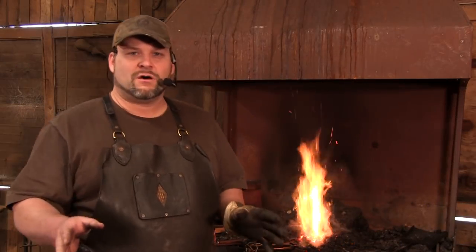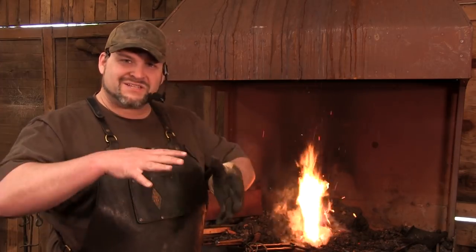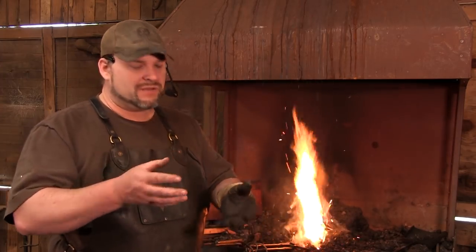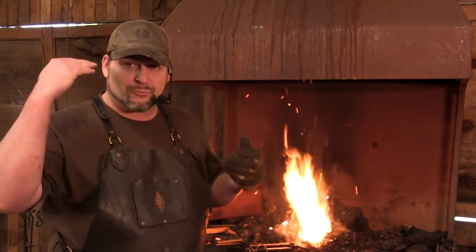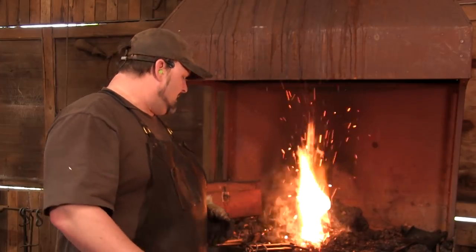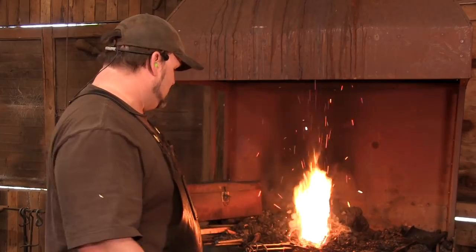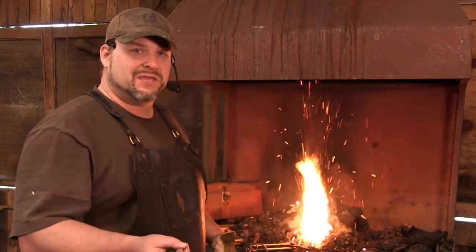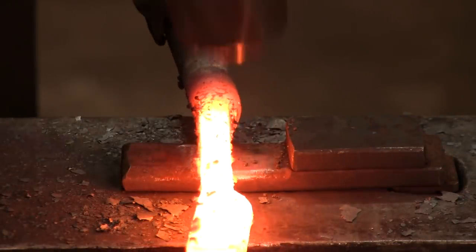When you're making a pair of tongs, the front side of the tong is where you gotta think. Because the way that metal's gotta move parallel and perpendicular, that'll mess you up. That was always kind of an issue for me. I couldn't ever really wrap my brains around it. The reins just really are gonna require a lot of elbow grease. It's that front of that jaw you gotta think about and get right. Reins, just a lot of hard work. I'll set this over.